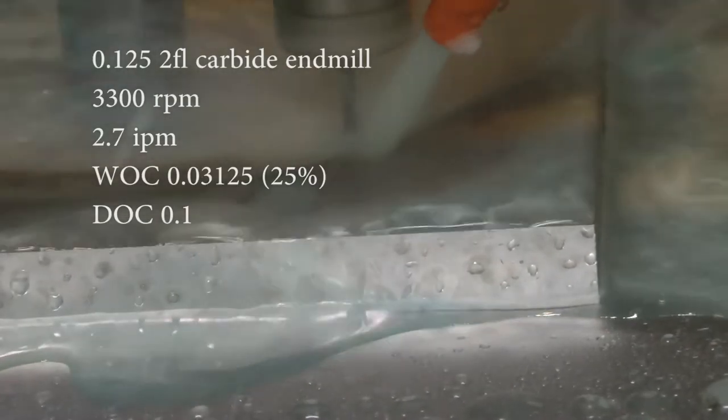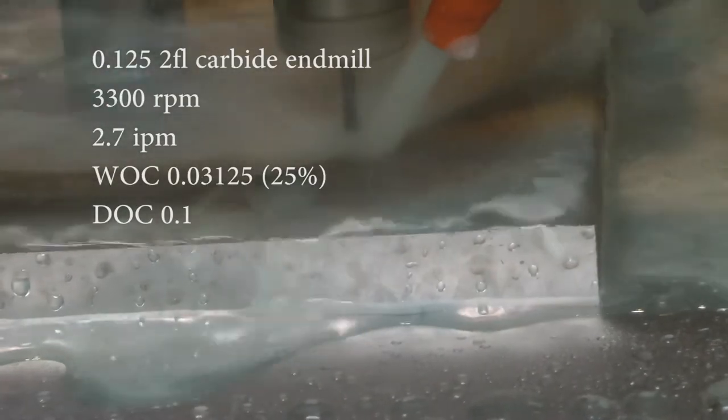When I switched to the 1/8 inch carbide end mill, I was super concerned with breaking it. So I probably went much more conservatively than I should have, but I was just worried about chips building up in those holes and not being able to clear out properly. It worked fine, and I probably could have gone a lot faster.